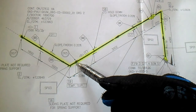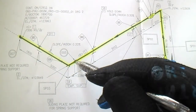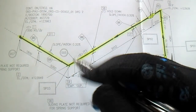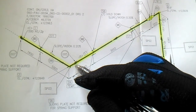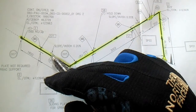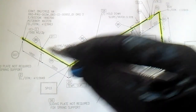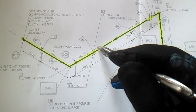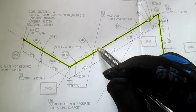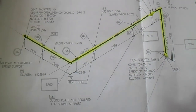This is a joint — check the joint. This is important because sometimes the joint has masking tape. You must check it or remove the tape, because sometimes the joint is only tacked and you must verify if it is already welded. We also have a slope of 0.20% — check the slope. Check the type and size of materials and also the bolt size, length, and gasket — these must be correct.